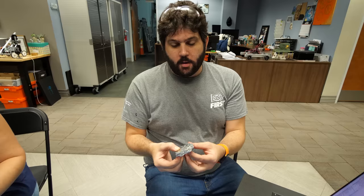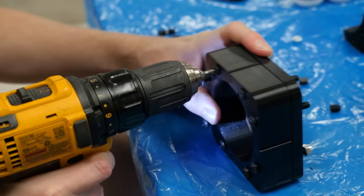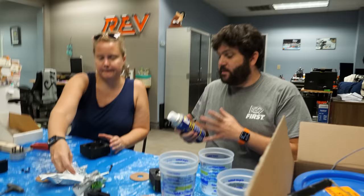So we decided that we wanted to do custom wheels for Switchback so that we have the ability to try different durometers, as we're not sure what the arena floor is going to be like. We laser cut all these little parts with little interlocks and then made custom molds. So the main thing I will say is that when you spray the mold release, anything it touches will not mold onto. Yep, I know.